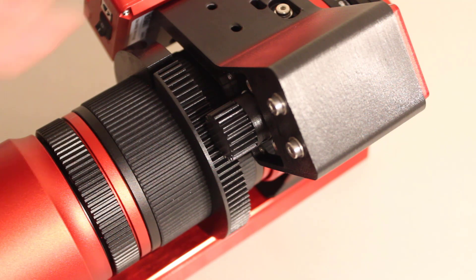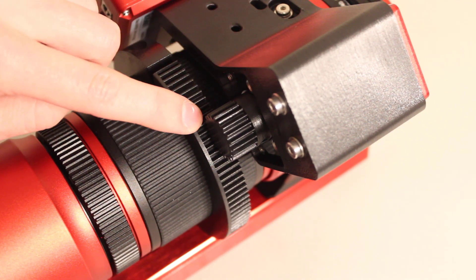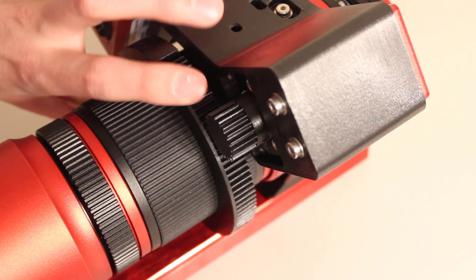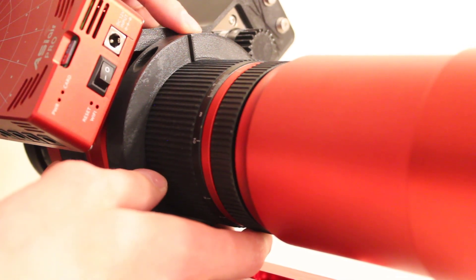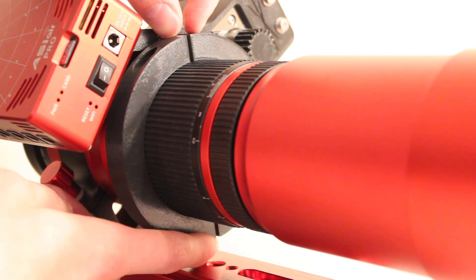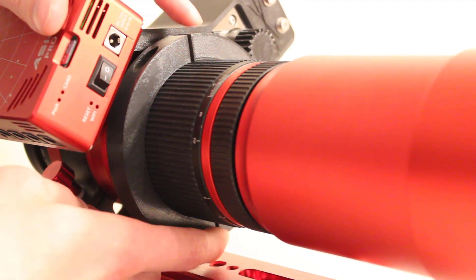Now that the black cap mount is securely installed, you can see why I didn't finish tightening the large gear — I didn't know what position the small gear would be in until the mount was installed. The two gears are only about halfway touching. Now that I've loosened the large gear, I can push it forward, make sure everything is centered and straight, and then tighten it up. When tightening the big gear, make sure it's straight and not canted in either direction, and tighten both sides equally. Uneven tightening creates weird torque on your focuser and puts more stress on the motor.